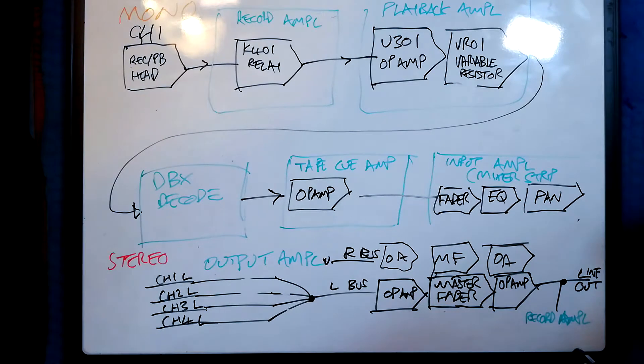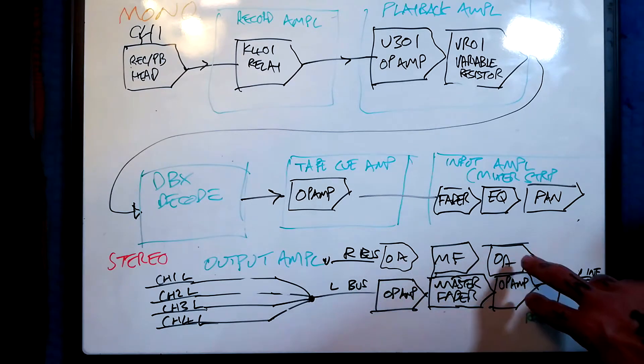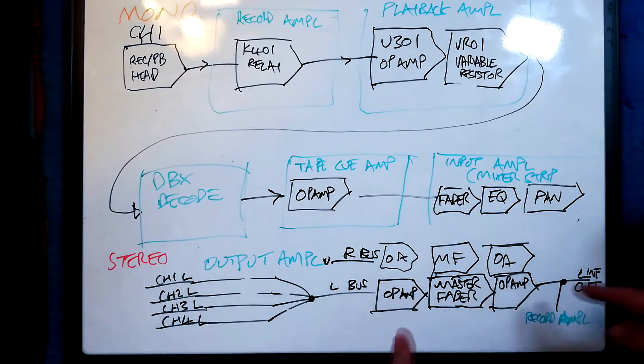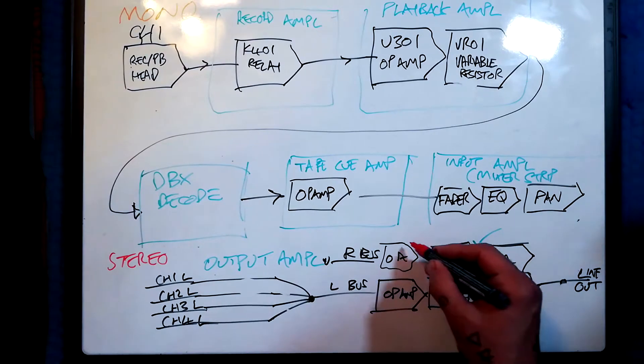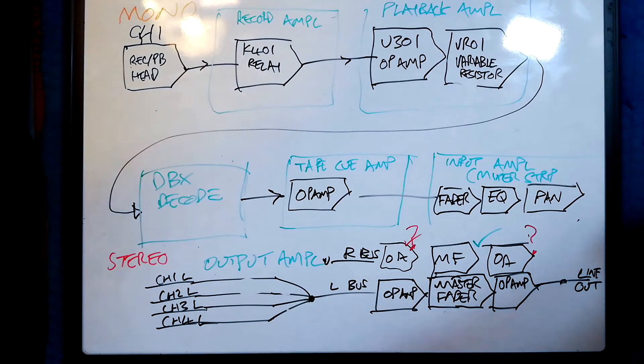What was happening earlier when I was confused: I thought I had off-camera tested and established that I was getting both sides of the signal from the line out, which would have indicated that the master fader was okay and both sets of op-amps were alright. The fact that I had one dead channel on the headphone would have been down to the pair of op-amps in the record amplifier that powers the headphones. However, when I went to film it I was finding I only had one side of line out as well. That might mean we've got an intermittent fault, which is a pain if true. I've now decided the headphone amplifier isn't the problem, and I'm working on the principle that either this side or this side of that fader has got the problem.